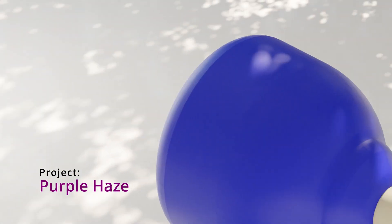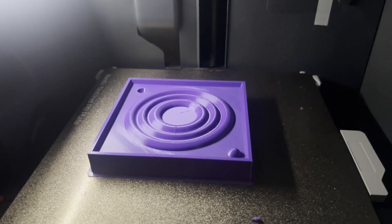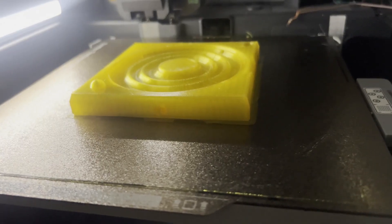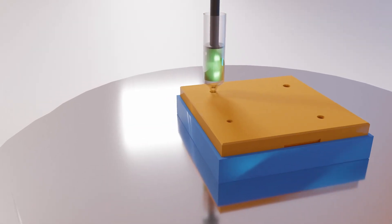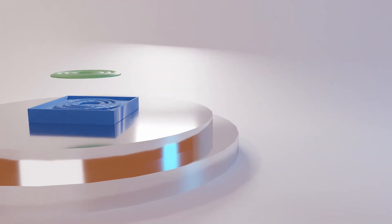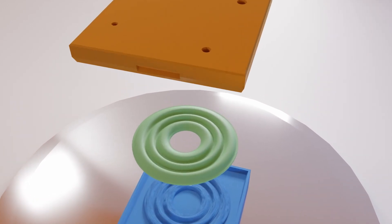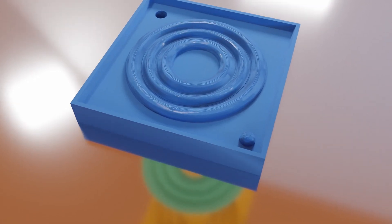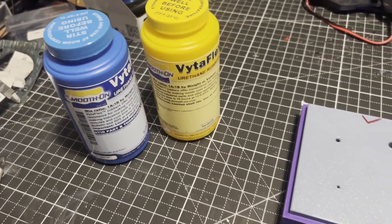It's very similar to version 16, being a derivative of it. The main difference here is the suspension. I used a 3D printed mold to cast a two-part rubber compound. These molds were aligned with semispheres and drafted sides, which were then clamped together. A two-part urethane rubber was then injected into the top with a plastic syringe through the hole, pushing air and excess urethane out the other three vent holes. After curing, the molds were separated, and the clean injection molded part was able to be released, leaving a perfect replica of the 3D printed suspension part used in version 16. This two-part urethane material is about Shore hardness 60A, which is much softer than most TPUs available for FDM-style machines.